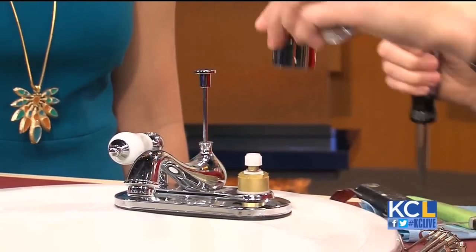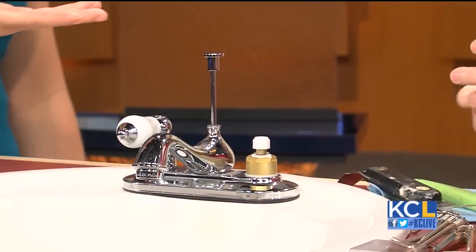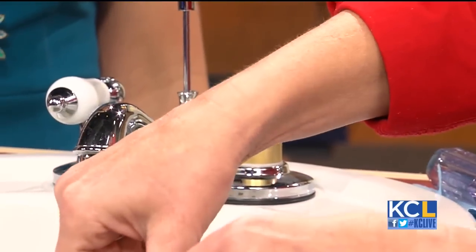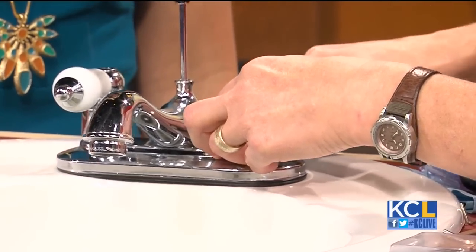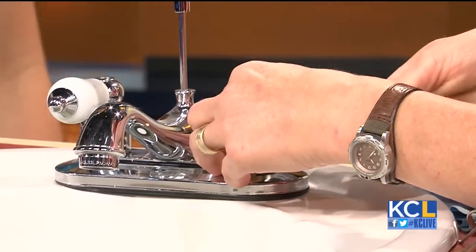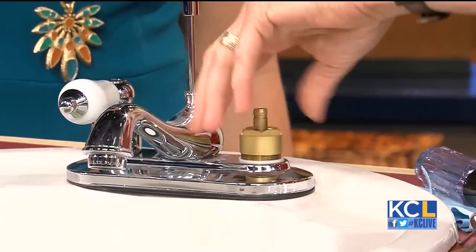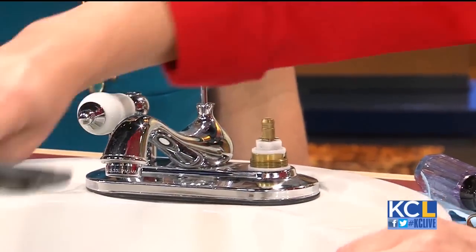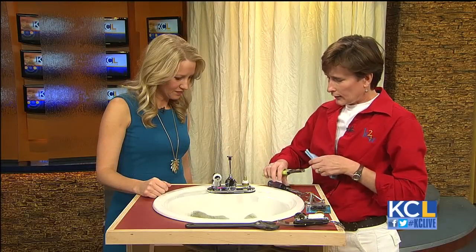They're all different, so double-check what you need online — there's all sorts of stuff available. This is also the kind of thing covered in a basic home repair workshop. Now we move this small piece, and you can see this big nut holding the valve in place. It's not on there particularly tight, so just loosen and remove it.